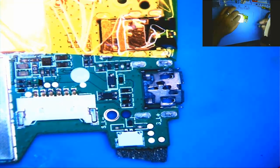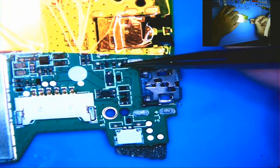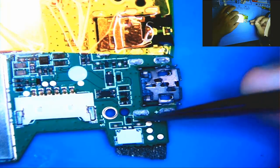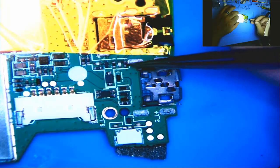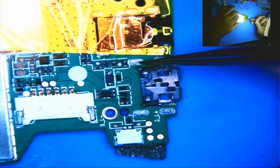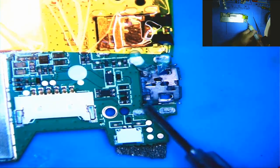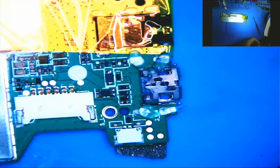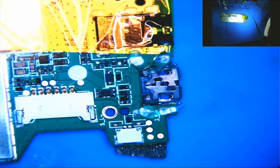Looking out for nearby components — looks like probably a resistor there and a couple of other components. This one is really close, so I don't want to add too much low melt solder where it's going to catch that and pull it away. Let's try and clean this thing like we're supposed to. Looking pretty good.